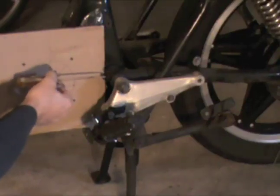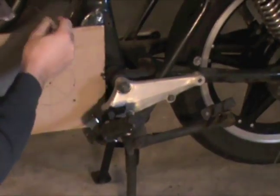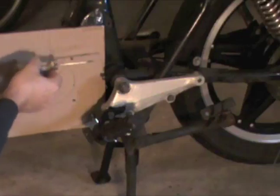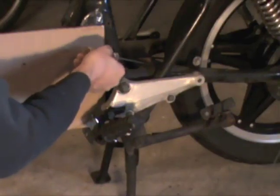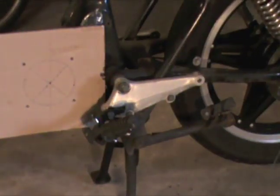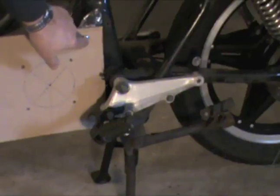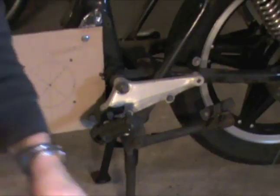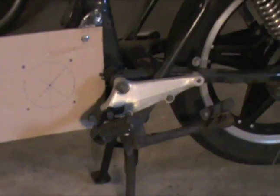This is only aligning it from the center shaft this way. Now I must align it in and out to get the chain exactly in the position I want. That would be my next part — to work out how far back the 13/16 or 21 millimeters back to the center of the chain, which I need to mark and put strings on. I'm lucky that on my plate the mounts for the old motor are there, so I'm using those holes for my template, drilling them into the steel plate so I can bolt it on. I'll use those holes, make spacers and weld it. Pretty straightforward but it takes time.